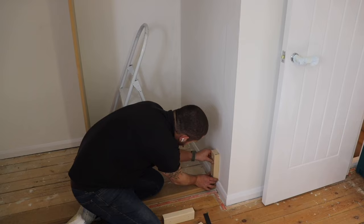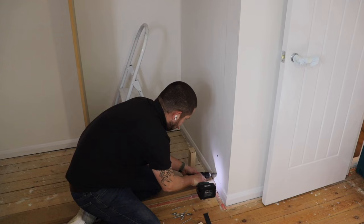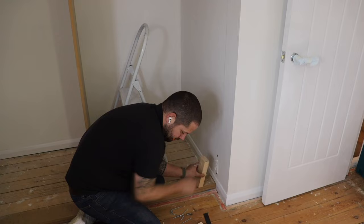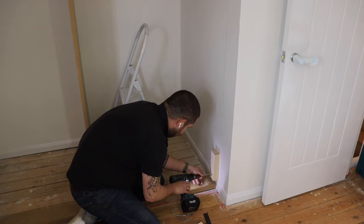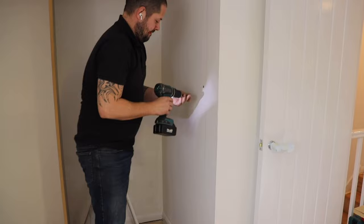Here we're packing out for the outside. My doors are 1500mm in their closed position and my opening was 1630mm, so I had to make the openings a little bit smaller. Two bits of this timber come to 75mm, and then I put a bit of 6mm MDF on top of that, which gave 81mm overall — that took up the space required.